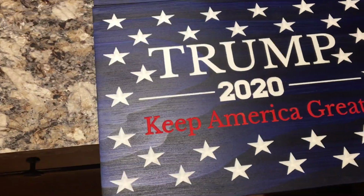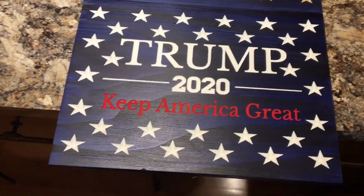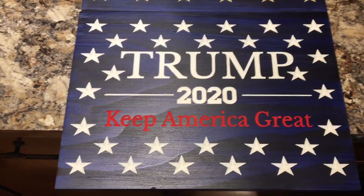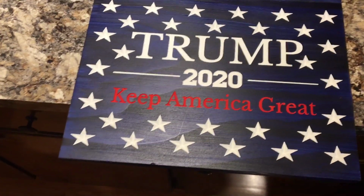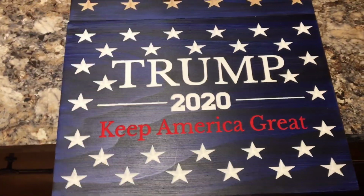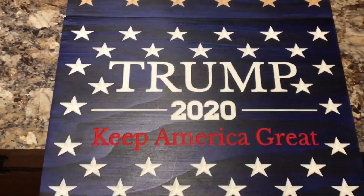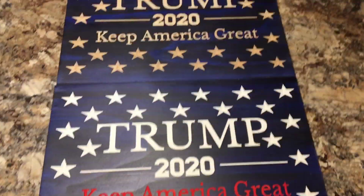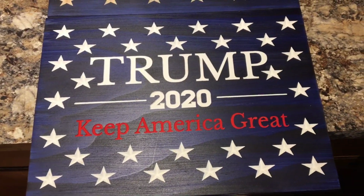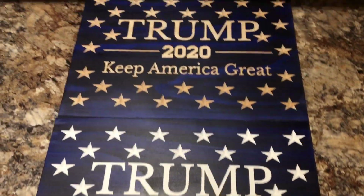I did have a little bit of trouble getting the Oramask up. Sometimes that happens, and let me know in the comments, maybe the heat gun isn't the way to go. I know it's helped me with my signs, because there's been times where I pulled the Oramask up and it pulled up some of the wood because it was clinging to the wood so much. That was before I was really using the premium pine as well, so that could have been it. But if there's a better way to get the Oramask to release, let me know. The heat gun's worked for me, but I'm always hoping to learn some new things and make better stuff in the future.